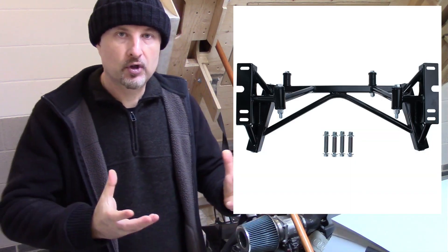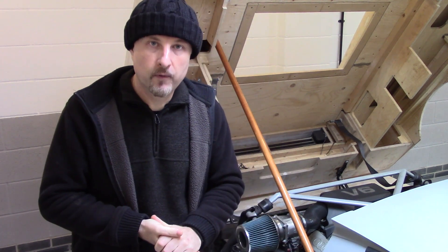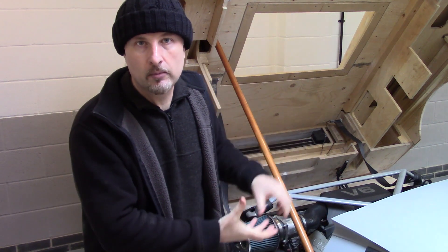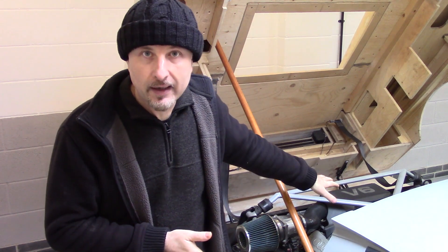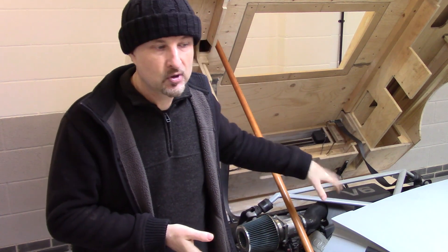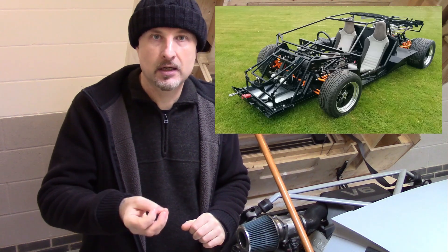My idea was to have a fabricated cradle to fit a certain type of engine — like a V10, V6, whatever — that would then bolt into a universal chassis. One thing I wanted to avoid was making it difficult to pull the sump. That said, it's really easy to pull the engine and gearbox out — once the clamp is removed and the brace is out, you bring in your crane and it pulls out. So if you ever did need to get to the sump, you'd probably just pull the engine anyway. When I design the turbo chassis, I think I'll come up with a cradle system to support the engine and gearbox, a bit like the Countach chassis I did — there's a playlist on my channel for that.